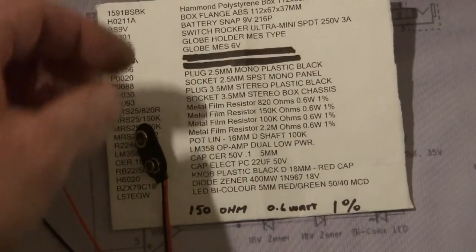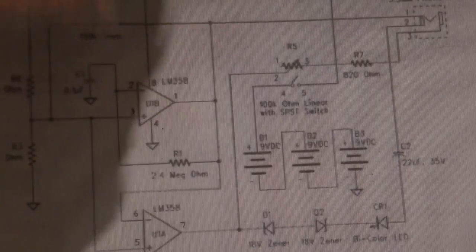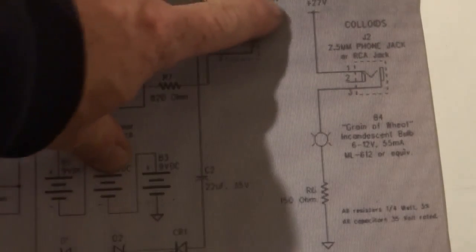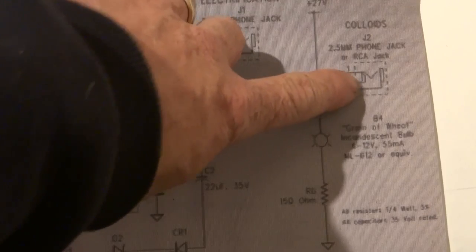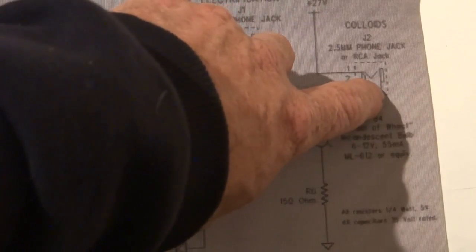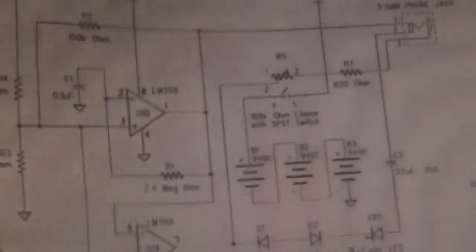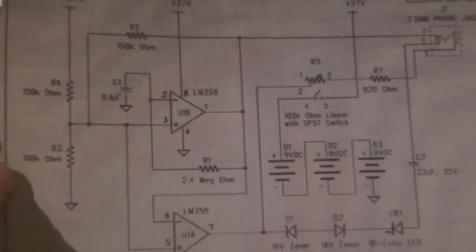For the silver maker, that's basically it there on the side — positive on that side, then the 150 ohm with the light, and that goes to the other plug. So when you plug in the two electrodes, it basically makes a power path through that. That's a basic setup for that one.